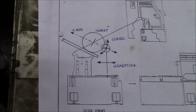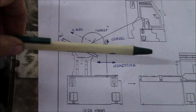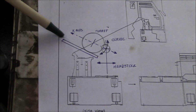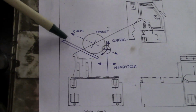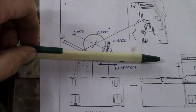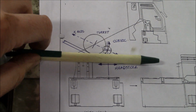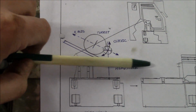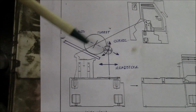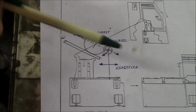This machine has a curve ball that makes it a little more complicated, because it's not a true slant bed machine, but the x-axis is still on an incline. So basically there's a ramp inside the machine, or a wedge shape. The x-axis is inclined, but the headstock mounting surface is horizontal. So the adjustment for the headstock is side to side horizontal and rotating in the horizontal plane, but that's not the same plane as the x-axis. So that makes it a little more tricky.